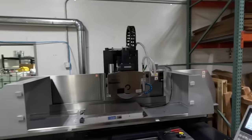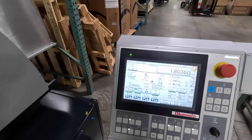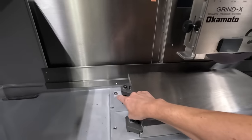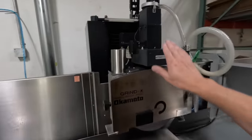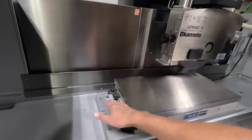There might be some manual down feed click options, but there's not what ours has, which is the middle tier — what's called an automatic grinder. The reason I really like this as a step up is it has just ever so slight hints or fringes of CNC. It's not a CNC grinder, that's the third tier. But what this can do that was an absolute must for us is automatic dressing. You can come to the screen and tell it your part is at, say, two inches, you want to grind 10 thou off in one thou passes.